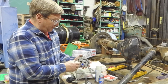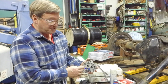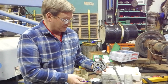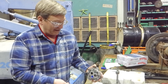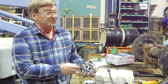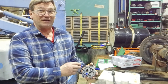Another version of that instead of having a valve sliding back and forth is with two check valves. We had one place I was at — we had ones that had two check valves. The high pressure side would continually on one side get plugged up with little pieces of crud, and then it would blow the seals out. At first I put better seals on it — I thought we were losing the seals because we had lots of dirt and crud. Then I got to actually tear one of the pumps apart. I came in and started ordering them out of the warehouse, drilling out both sides and putting a set screw in the plug so that we could get away from those check valves. That took care of the leakage problem.